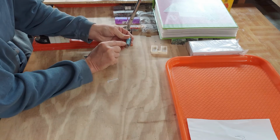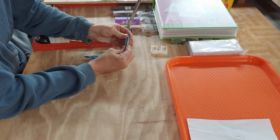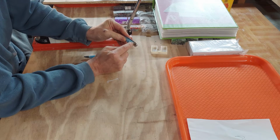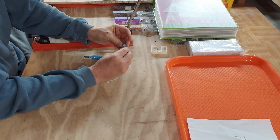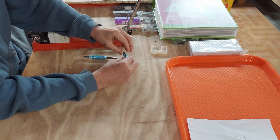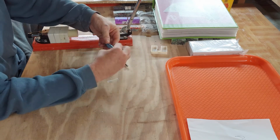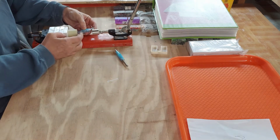That said, there's a white patch in there where the glitter's not so heavy. So I'm going to put the clip over that. Now the drawback is if you see it on the sides, the clip's going to draw attention to it. So you keep that in mind. Sometimes you got an accent on your blank. You want the clip to be on the pretty side that you're going to look at. As the pen's laying on the table, it's going to naturally go to that, and you want that to catch your eye. But in any case, be cognizant of where you put the clip.